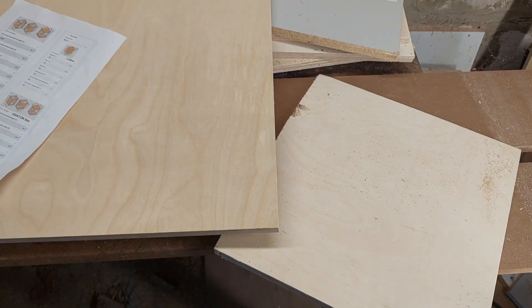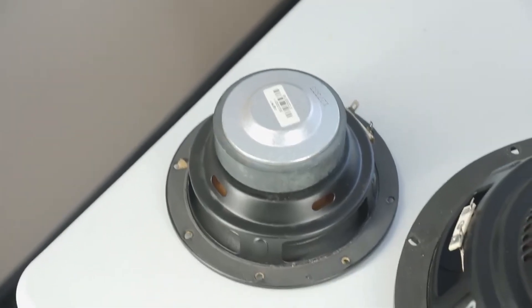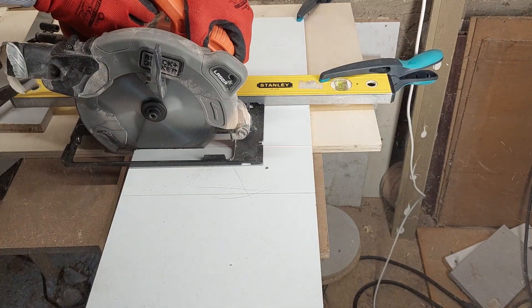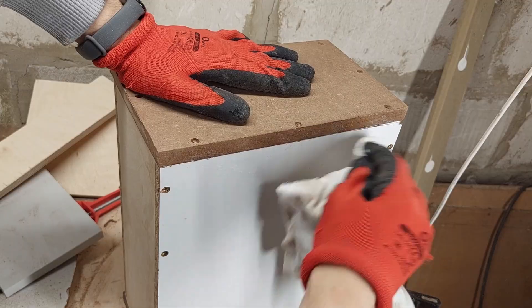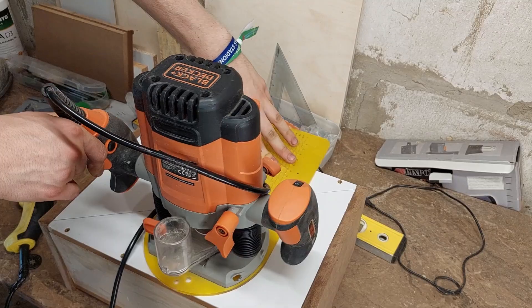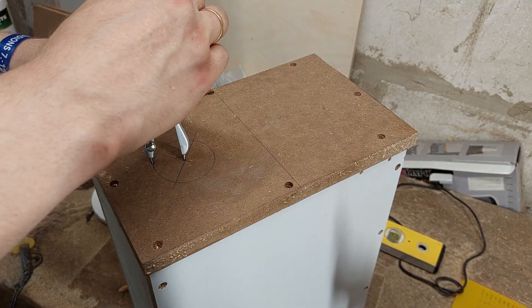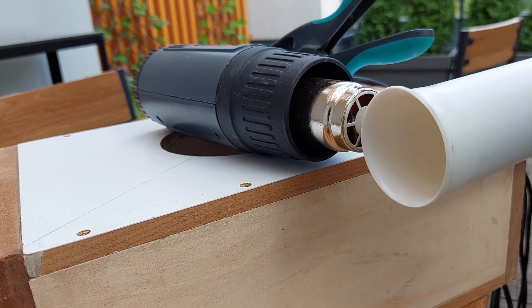You can use almost any material — plywood, MDF, or even chipboard from your grandmother's old furniture. The thicker the material the better, though keep in mind this is only a 5.25 inch woofer so no need to go overboard. When building the box it's important to make all seams completely airtight. The woofer hole should preferably be placed symmetrically in the center of the box. Since the bass reflex port is quite long I placed mine on the side. You can buy ports online or try making one yourself.